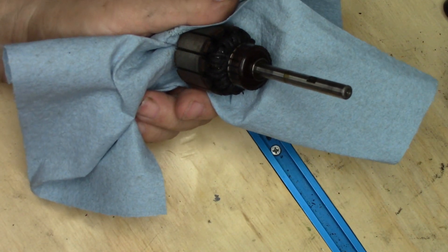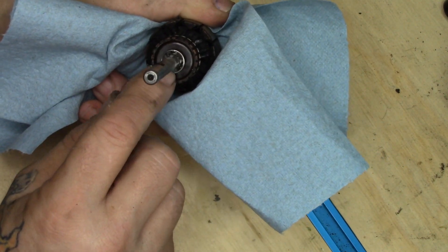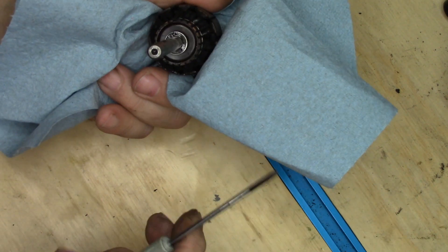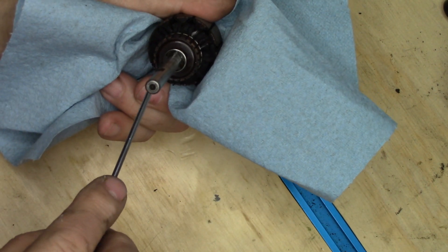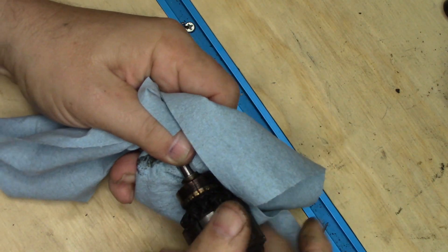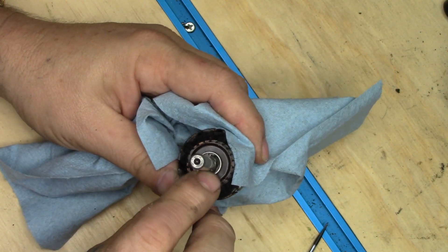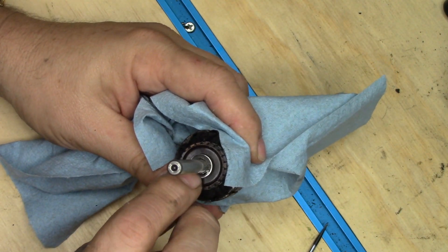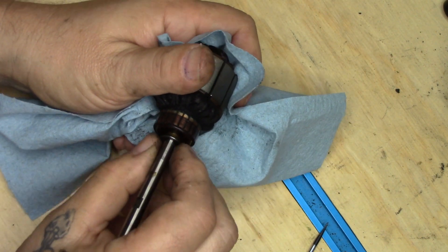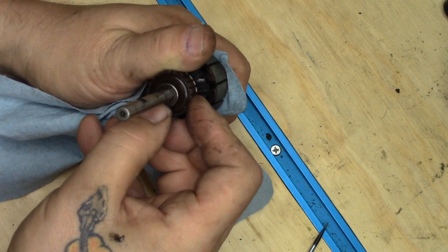I've commented below about there usually being a fiber or plastic washer below the armature assemblies — and you can see there is a plastic washer here, actually held in place by shmoo. It's spinning very close to this flange. If that doesn't want to break free because of surface tension, I'm just going to leave it sitting there spinning in its shmoo.